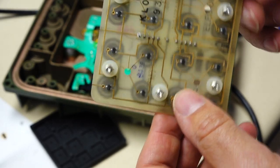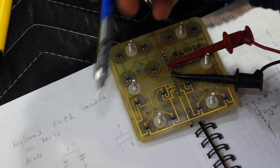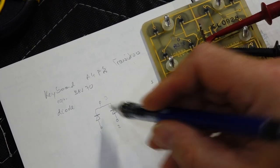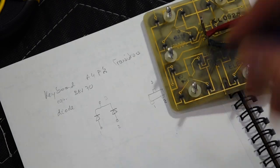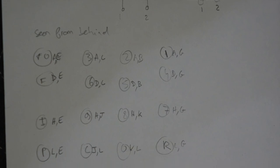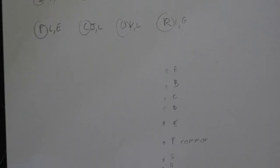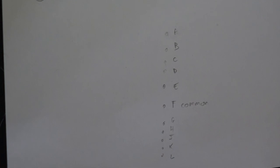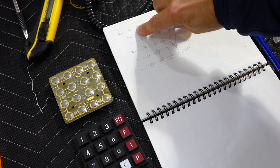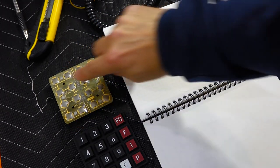This is much smarter than I thought. This little guy is actually a dual diode. What it does is that each button will ground two pins, so this is getting more complicated by the minute. The military keyboard is not arranged at all in a simple matrix arrangement, as most common phones are. I would have to do a serious rewiring of this PCB to make it compatible.